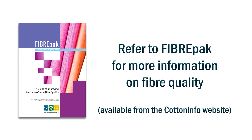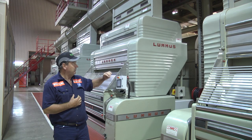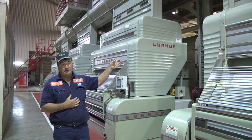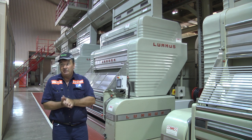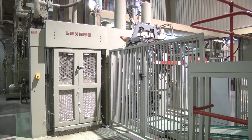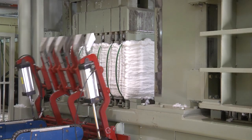Because the deductions are fairly high from going from, say, a three-leaf, which is a base grade, to a four-leaf, we generally double lint clean most of the cotton nowadays and try to remove some of the small pin trash that you get. We're back down into like the five thousandths of an inch type settings. We'll actually run it through a second stage lint cleaner, which will make the cotton a lot more uniform and give it a better presentation. Then we take it up and form it back into a bat for pressing where we add moisture.